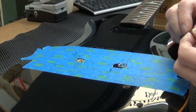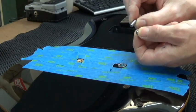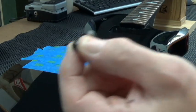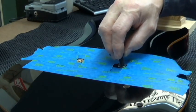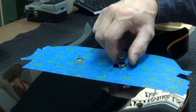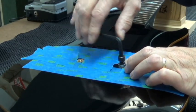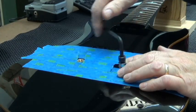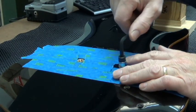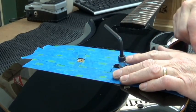The first thing I do is take the longer of the two dowel pins — there's two here. You drop the long one in the hole, take your metric bolt, screw it in until it bottoms out, and then use the allen wrench, and you'll see with very little pressure it'll crank up. In most cases, it'll come out with just the one dowel.